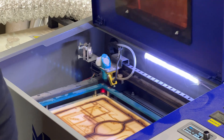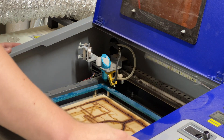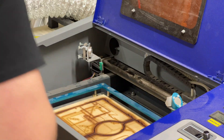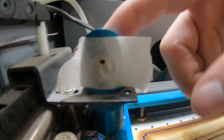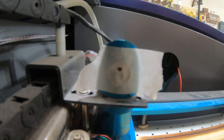Turn off the laser, open up the lid, and we are actually a little bit high. You can see on there that we are a little bit high — we're up at the top end of this hole. So that means that on this mirror we are not hitting it in the middle. We're going to go ahead and work on aligning mirror two.